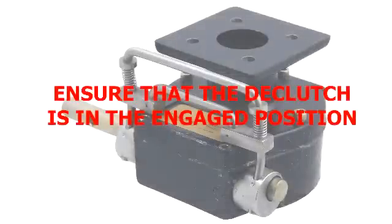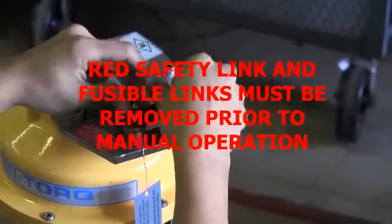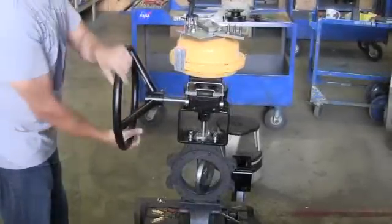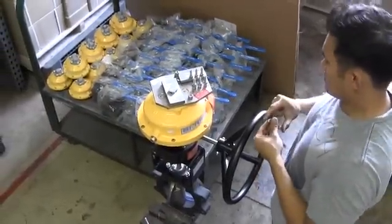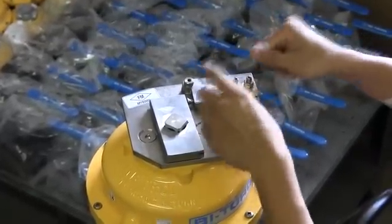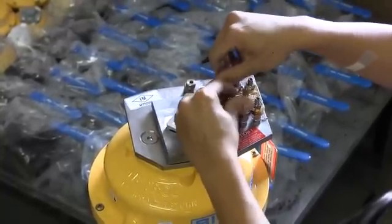These units will be armed after following these easy steps. Make sure the declutch is engaged. Then remove the 5/16" retaining nuts either by hand or by using a half-inch wrench. Remove both the red safety link and all fusible links before manually operating the valve. Slowly turn the declutch hand wheel counterclockwise toward the open position until the valve is fully open and the declutch has reached its stops. Make sure the pivot arm is moved into the proper position and then reinstall the fusible links. Do not reinstall the red safety link. Then use the nuts to secure the links. Do not over-tighten the nuts, as overtightening will stress the links and could result in improper functioning.